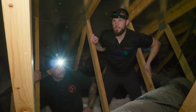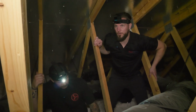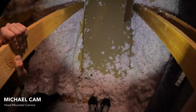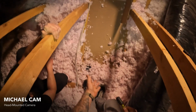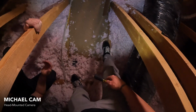If we didn't have the FAU as an available receptacle to plug into, maybe it was hardwired or on a switch, what would be your alternative considerations for pulling power? The smoke detector that I'm sitting on. Conveniently located. Okay. So if necessary, you can pull power from a smoke detector, create a plug up in the attic, plug right into it from there. Cool. Any other things that we consider as it relates to this first attic site inspection?